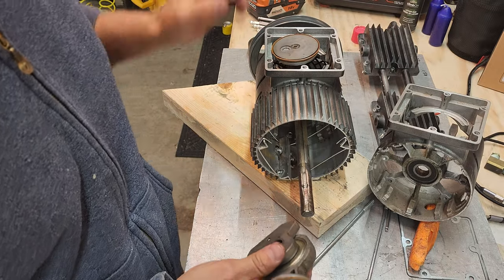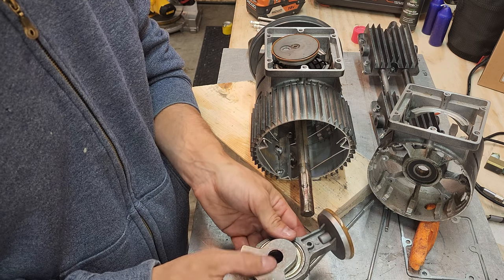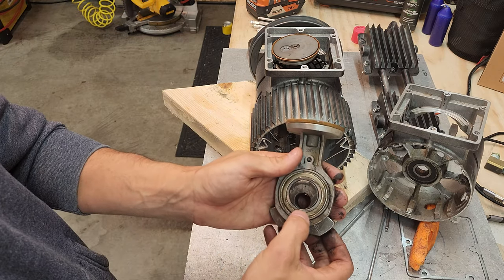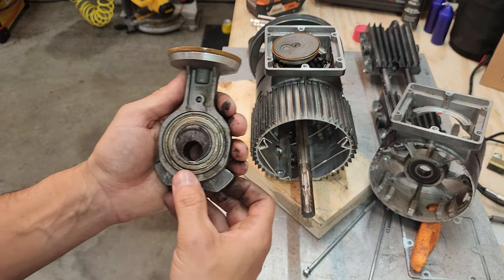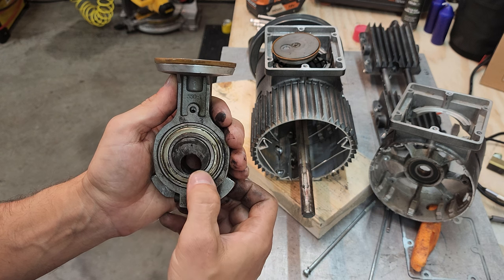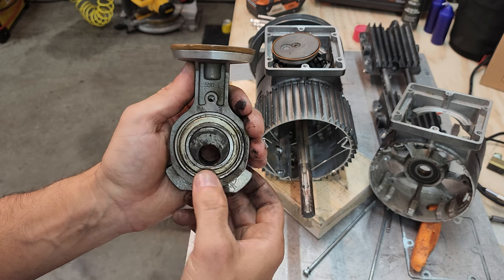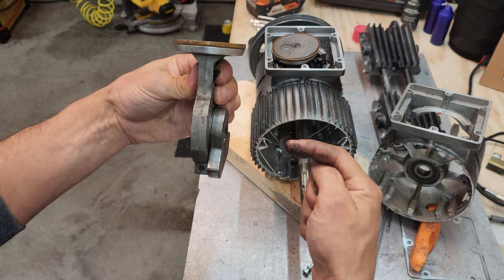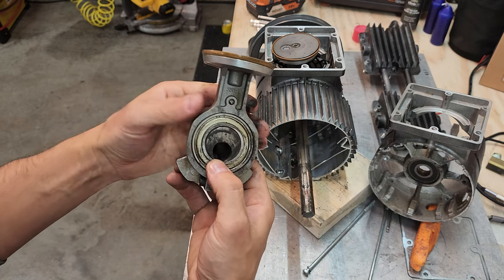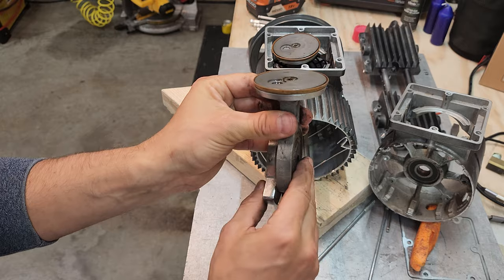As I drilled through, this made the same hole, perfectly straight. But the size of that hole — this bearing right here — you see the inner race of that bearing? You've got the outer race, the cover for all the bearings, and then the inner race, that little silver part. That inner race is a really, really hardened material. So when the drill came through from this side and hit that race, it tilted it slightly. It ended up coming in at a slight angle, which caused the wobbling of the whole shaft assembly.